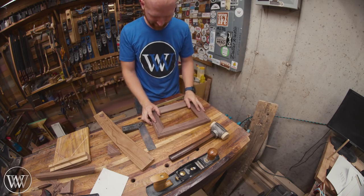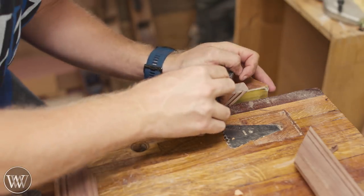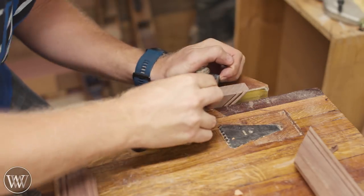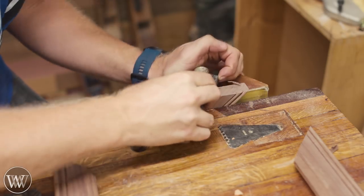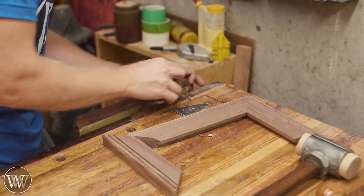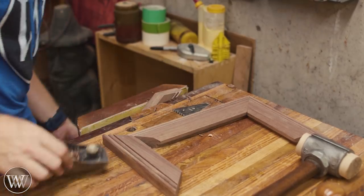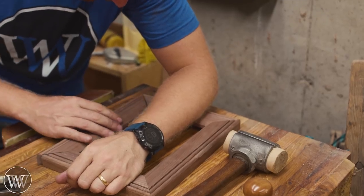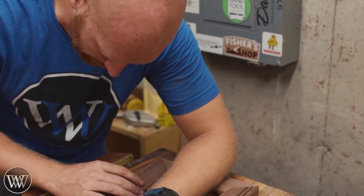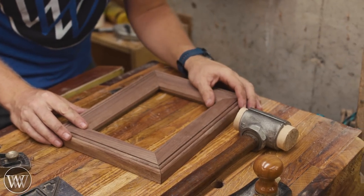Now we can test it, make sure that everything is just the way it needs to be. If there's any adjustment needed, I'll usually just do a little trimming with a block plane to get it closer to the angle. Just make sure that if you do it to one corner you also do it to the opposite corner — that way the whole frame slides together. If you just do it to one corner they never quite fit. Then we get it exactly the way we want it: nice tight corners, 90 degrees all the way around and ready to start joining.